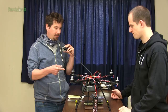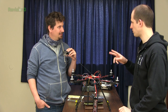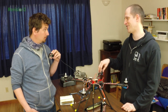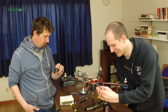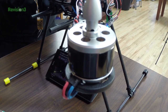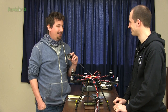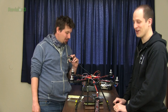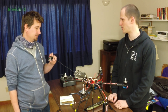There we go — it powered up. I love that, although I don't remember plugging in a speaker. The motor controllers actually oscillate two phases of the three, causing the motor to vibrate — the motor is actually making the sound. The motor is the speaker! So you're saying this motor right here is acting as a speaker? Yes — let's unplug and replug it. Very subtle, but I totally saw it wiggle. It's moving — that is fantastic. It's like those Mozart-from-a-disk-drive things. In some cases you can even program the ESCs to play music that you compose yourself.